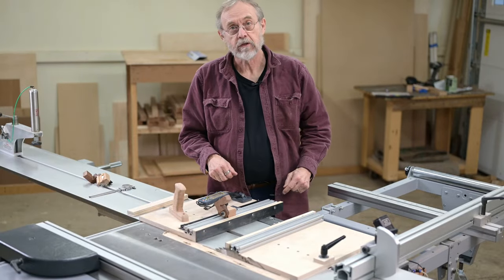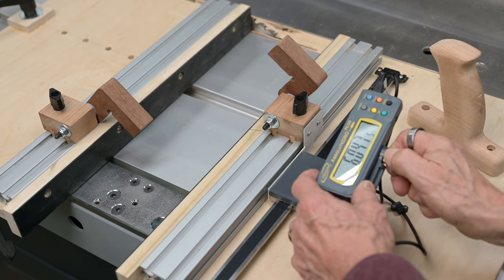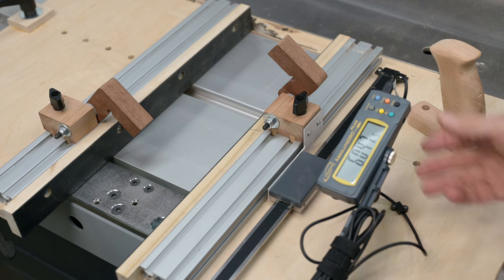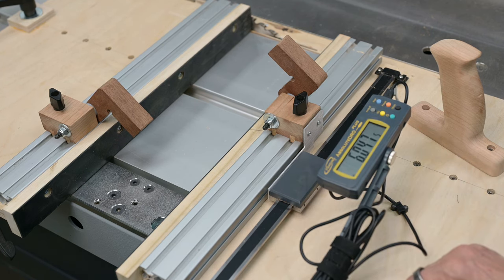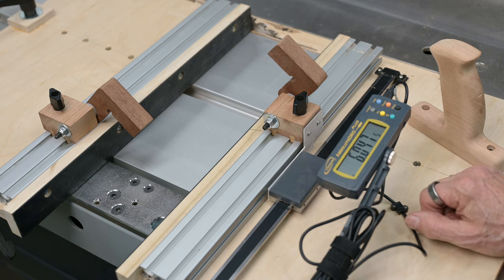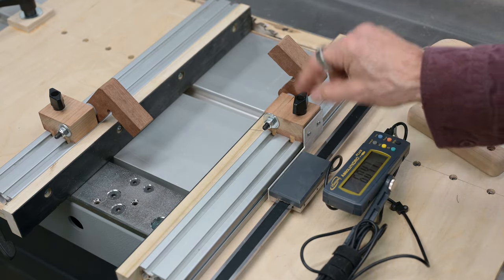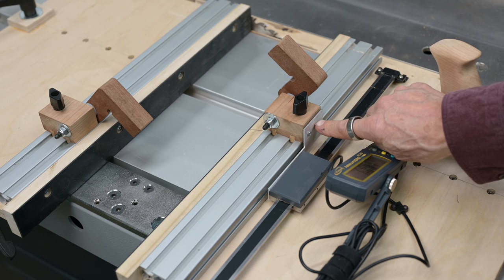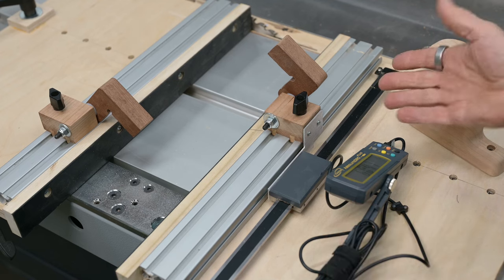Come over here and let's have a look at this DRO and how I have it set up. The brand is iGaging DRO Plus — kind of cheap, a lot of plastic on it, but the big thing for me was it was cheap to buy and so far it seems to be holding up to its accuracy claims. This part likes to move on me, which bothers me a little bit. I haven't had a lot of experience with it yet so I don't know that I could recommend it — it may come with use. To hook this up, I had to fashion a little connector — one to hook to the DRO and tie it in to the stop. I got some 1/16-inch aluminum, cut it out, and just connected it. Very simple, works fine.